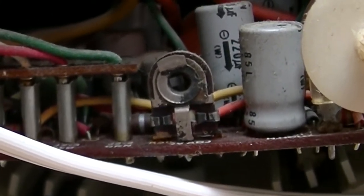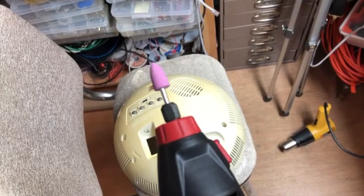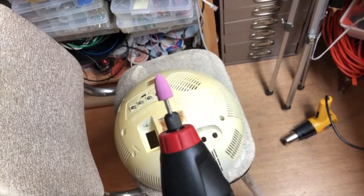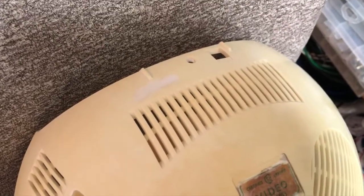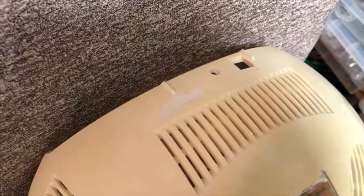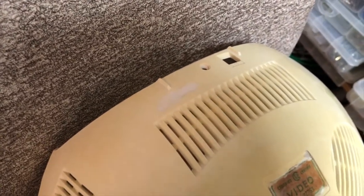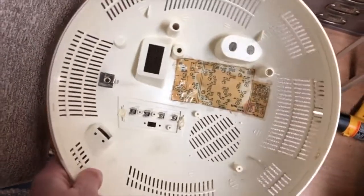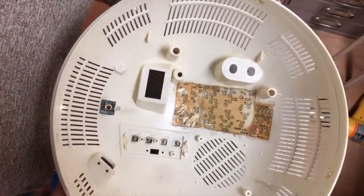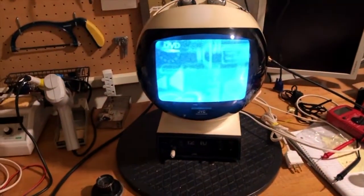The adjustment for it is right there in the middle of the signal board. I mentioned before that the name of the prior owner is still in the case — right there. I'm going to use this grinding tool with a rounded stone at the end and be very, very gentle with it. What the stone does is it softens the plastic, and as long as you keep the tool moving so it doesn't gouge the surface, you'll get pretty good results.